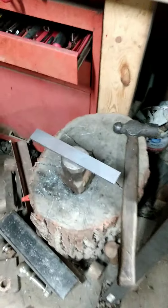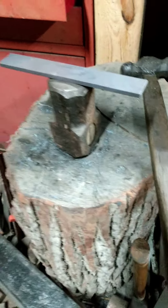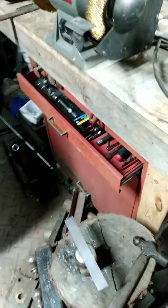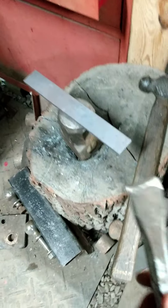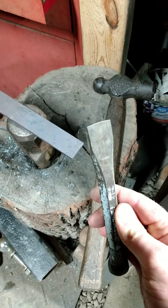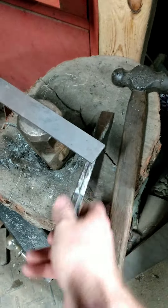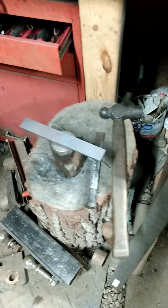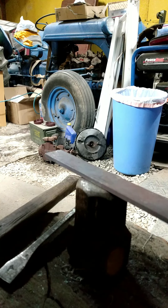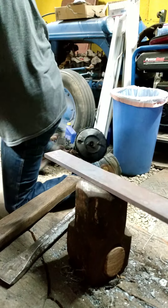Here's a quick look — I've got a sledgehammer head and this old stump here, and I've got a piece of flat steel on top. I use this homemade punch — this is an old chisel that was laying around and I reground the end of it, and that's what I'm going to use to hot punch the nail nick in. My forge is running out of gas but it has just enough to get the blade hot like I needed.